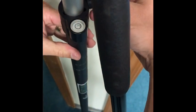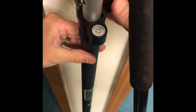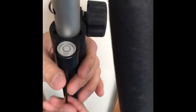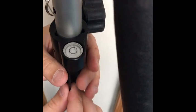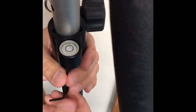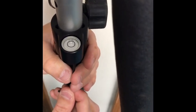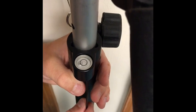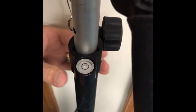Our bubble is loose but that's alright. I'm going to release the neck so it can sit freely and move around, because no matter where it spins at this point it should be level anyway. I'm going to grab my Allen wrench and tighten each one of these slowly but surely — turn them a couple, go to the next one, turn them a couple. Go just nice and light, don't crank on it at all. They'll slowly get tighter and start to get a little grip. When that happens you want to move really slow and bounce from one to the next.